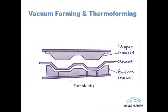Now the advantage of moulding using thermoforming is it's going to apply more detail or allow for more complex design details to be added to the shape. So if you wanted for example to add letters, symbols, or even achieve slightly sharper edges to the mould then thermoforming might be a better choice.